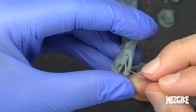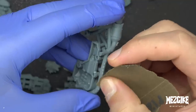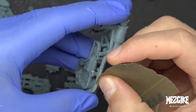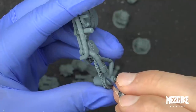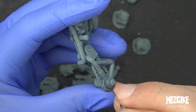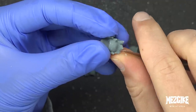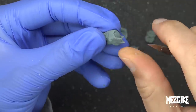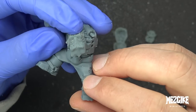So to clean them up, all we do is just get a bit of a scalpel, bit of sandpaper, bit of a file. You could even go and pinch your wife's nail files. Whatever you've got to do just to clean it up and smooth out these little bumps and the supports. Any imperfections that went on during the print. Make sure all the parts are going to fit nice and perfectly.